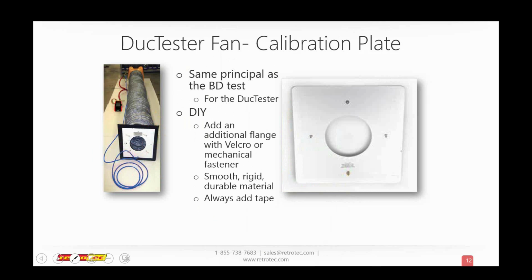Good point. If I didn't mention it earlier, one of the great things about the DM32 is that it can give you all kinds of results right in the gauge. So you're not tied specifically to just CFM or pressure, Pascal usually. So here what we actually did was instead of testing for pressure at flow or pressure at CFM, we're going to test for pressure at equivalent leakage, and you can do per square inch or per square centimeter. But the point is that, like Colin said, if you make your own hole, you could cut it 10 by 10, and then you know that you should have an equivalent leakage of 100 square inches or centimeters. And I completely agree that if you're not testing to a specific code or standard that means you have to use that, it's probably easier to understand.